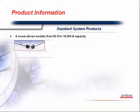The 100 series is the same as the 130 except it is equipped with 2 rails and up to 4 bearings. Same ball and Acme screw options as well as top and side covers. This series offers dynamic load capacities up to 3,100 pounds. The 110 series is the same as the 100 series except it comes with way covers over the screw and linear bearings. All options are the same as the 100 series.